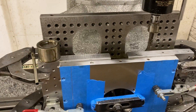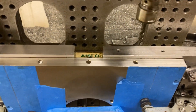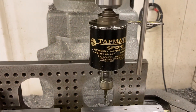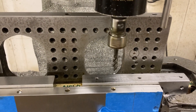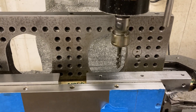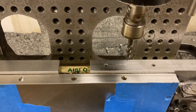We're tapping some 8mm by 1.25 tap holes right there. They're already all drilled out. We're going to tap them using the Tapmatic tapping head here. The tap is in the head, ready to go. I've already done one. I'm using a high spiral tap so the chips come up and out of the hole. The holes are blind, obviously.